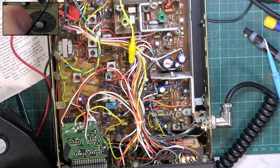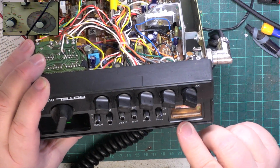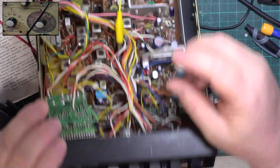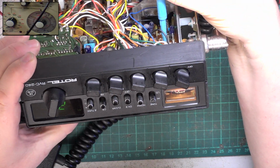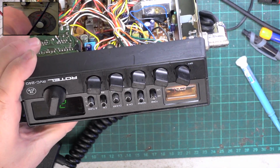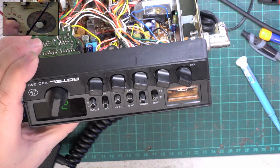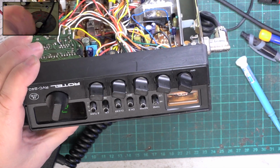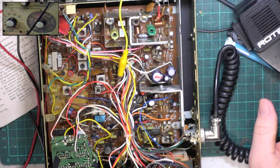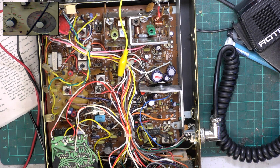And that just leaves us to do the S9 meter adjustment. And it's well over the top. It's saying plus 30 on 100 microvolts. So we just need to adjust that to S9. And as we turn the signal down, we'll go that down. As we turn it up, we might actually get plus 30-ish eventually. So there we go. We are done. And in the time available. We'll switch it on the air when I come back in 2 hours.